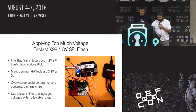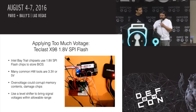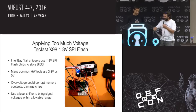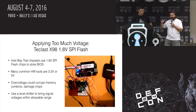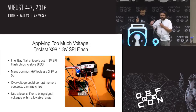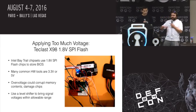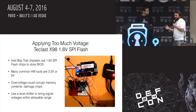Yolo wiring. I found another cheap Chinese tablet that has a 1.8-volt SPI flash chip — one of the first ones I poked at that was actually 1.8 volts. I didn't expect to worry about it, so I just opened it up, grabbed an FTDI chip, wired it up, and tried to dump the SPI flash contents. The system didn't boot, and I also didn't get any SPI flash contents. It turns out I needed to level-shift. These tools tend to be 5-volt and 3.3-volt tools, and if you drive something at a higher voltage than the device can withstand, you're going to do something bad. What happened is I actually just erased the flash contents — the flash chip still worked, the CPU still worked, but reading it at 3.3 volts made that 1.8-volt flash chip die.